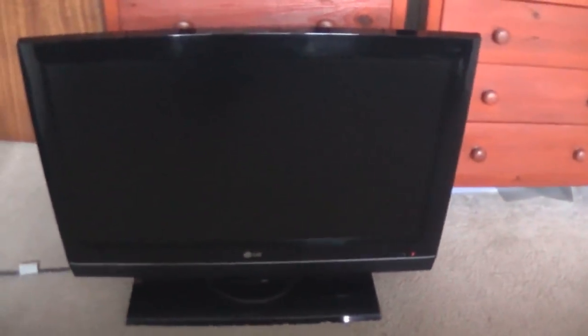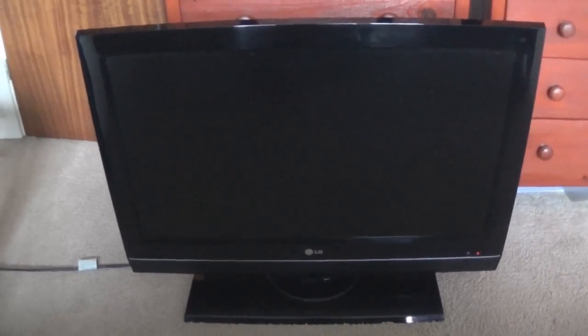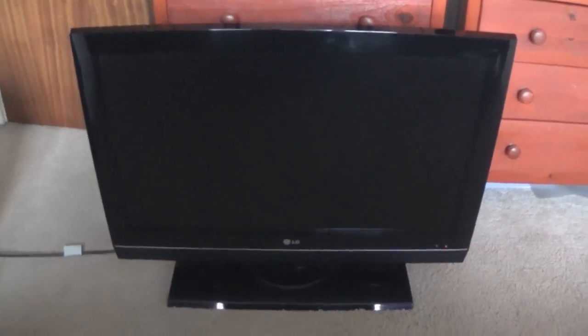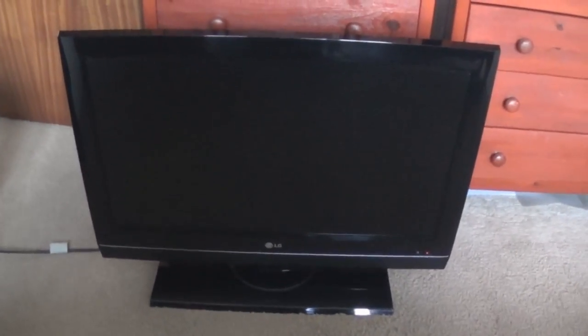And it doesn't help that the owner messaged me a few months before, saying the TV was taking longer to turn on and so on. And when it eventually failed to turn on, and I replaced the caps on the power supply, I noticed that the screen started to mess up. So, whenever your device shows signs of having a breakdown with the electronics, always get it checked out, because you never know, something else could fail and cost you a lot more. Because I'd say other technicians, not naming anybody, probably would have just said a failed screen or a failed main board on this one.